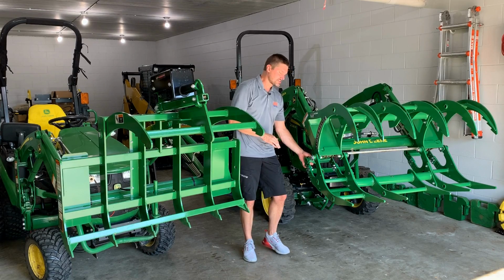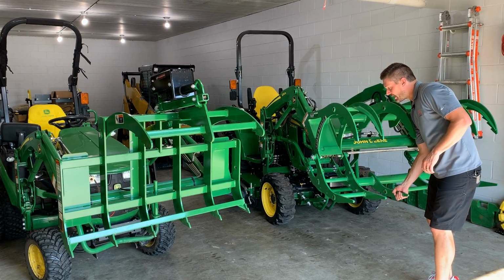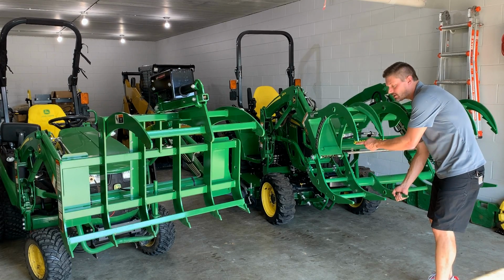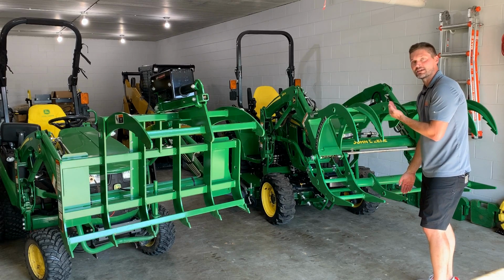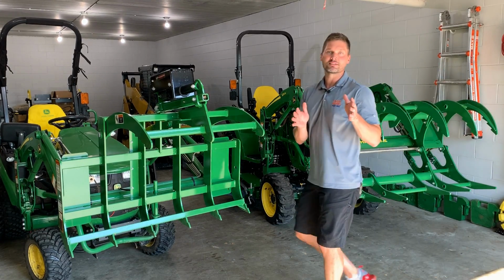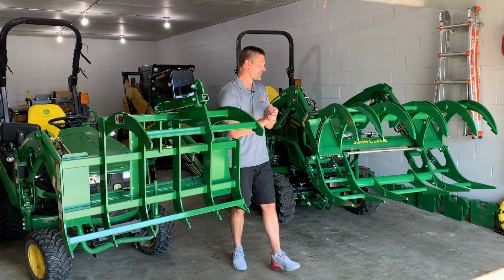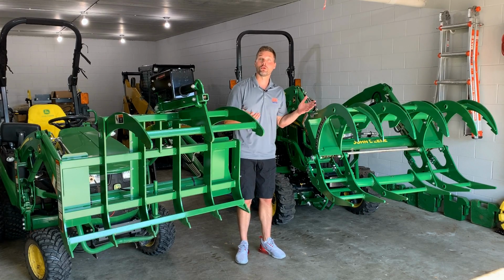And so you can see this bottom jaw here. Let me come over to this side so you can see. I'm just gonna pick it up and down, but take a look at that back side, okay? It's a stop. It's gonna stop and make contact in the bottom of the loader arm. Not a big deal in and of itself. The reason I say that though, is that the open and close function is gonna be essentially your curl roll function, okay?